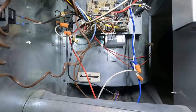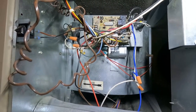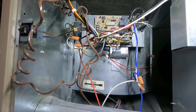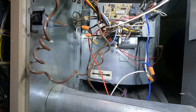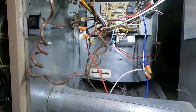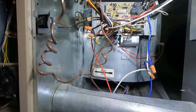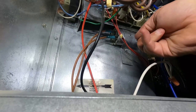These capacitors don't last forever — that's something you'll have to replace periodically. This usually happens when it's really hot outside and you need the AC, or really cold and you need your heat, so it's a good idea to have a spare on hand. If you smell something burning, a lot of times that's going to be your fan motor, which is another issue. But this one looks like it's just going to be the capacitor because I was able to spin the blades and get it going.